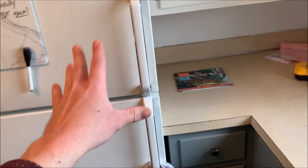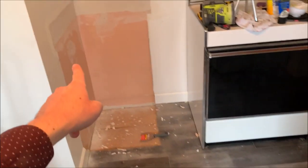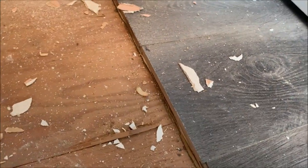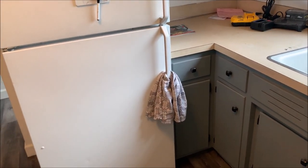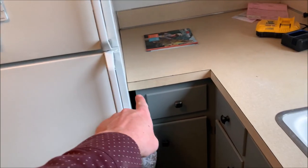In the meantime, I'm going to work on this. We're going to pull this fridge out and see how the new cabinet fits. I don't think it's going to fit, and here's why: these cabinets are probably the same as this cabinet where it goes right down onto the floor. We've got three layers of flooring here — that's probably about a quarter to three-eighths of an inch. These cabinets are 60 years old, the other cabinet's new, so we'll see how they line up.